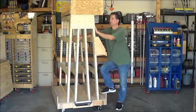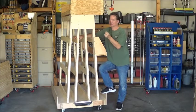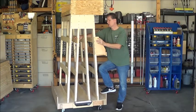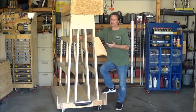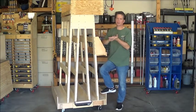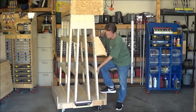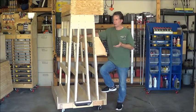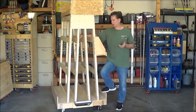And it really cleaned up the surface of the boards and made the edges of these cross members and uprights nice and crisp, so that when you're doing your half-lap joints with the dado blades, it just makes it easier to test fit them and find out when you've got it at the perfect depth here. So that was really one of the main reasons that I wanted to put them through the thickness planer. It just makes it easier to work with.